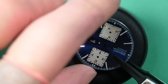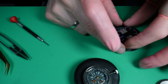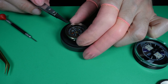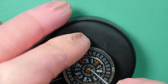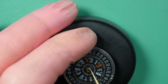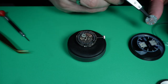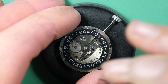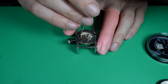There are a lot of second-hand parts for this watch, so it's possible that sometimes the hand or dial is not the original, but on this model it looks pretty original to me. Please put any knowledge in the comments. Now that the dial is removed, we can focus on removing the day ring and the calendar ring. First I need to remove these parts holding the center disk in place, using a pair of carbon tweezers. I'll store them in a box for delicate parts, and now I can start disassembling by removing the calendar plate on top.